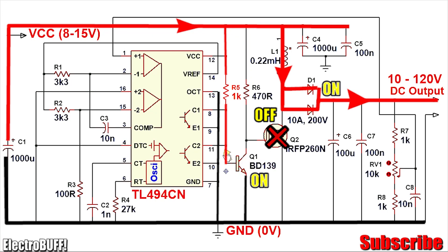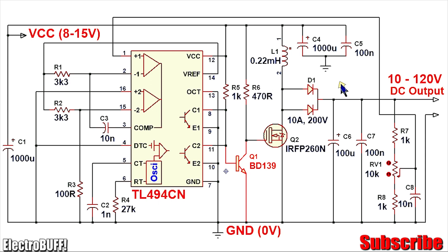After some time the transistors will turn off and Q1 will conduct because there will be a VCC reference at its base. When this happens, it will connect the gate of MOSFET Q2 to ground, forcing it to turn off very fast. The voltage across inductor L1 will then reverse and be in series with the power source, forward biasing diode D1. Current will flow through D1 to charge capacitors C6 and C7 and to power the output load.